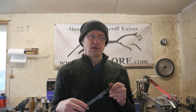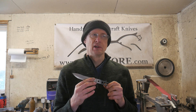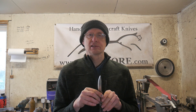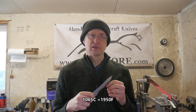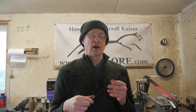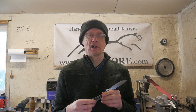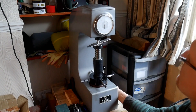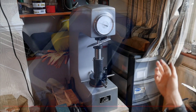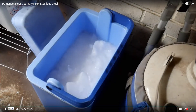I have not been happy with the first heat treatment that I ran. I austenitized at 1065°C and held the steel for 30 minutes, then quenched in the quench plates. Measured as-quenched hardnesses of 61.5 to 62 HRC. Then I put them in dry ice and isopropanol overnight. Measured the hardnesses the next day — they'd gone up to 63.5 HRC.